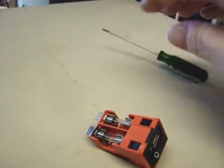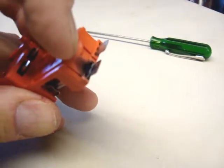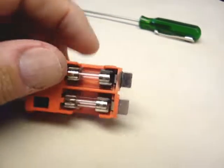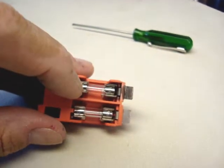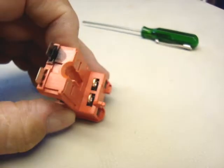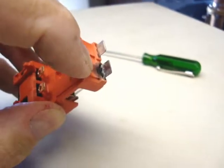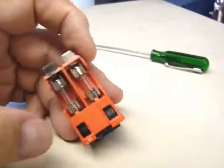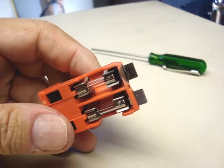This one had a problem earlier and I'll show you what happens when you run it on 120 volts. You see that? That got real hot. This fuse here on this side — this particular one — it finally blew, it barely blew. I actually salvaged this one. As you can see, that got burned, so I actually burnished the contacts and got it working again. That's what you can expect if you run these units on 120 volts.